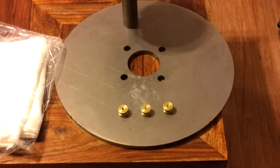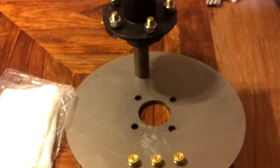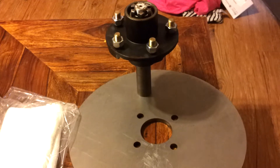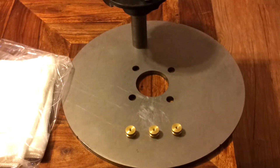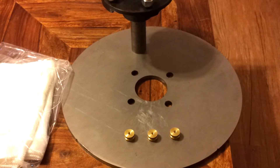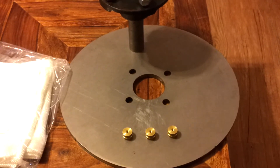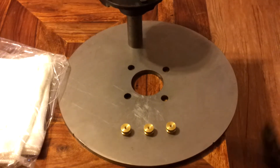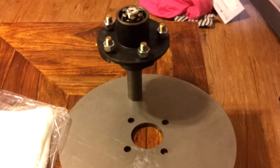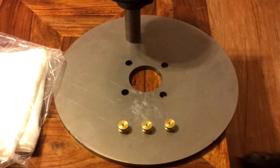One 14-inch magnet plate, trailer hub — and you will notice it's a 4-lug plate with a 5-lug axle stub. I did that on purpose. This is going to be the front disc; the 4-bolt pattern here is going to go to the blade hub. The other magnet plate will be a 5-lug, and I will re-drill a 5-lug pattern which is about a half inch bigger bolt pattern — I believe that's a 5x4.5 and this is a 4x4.